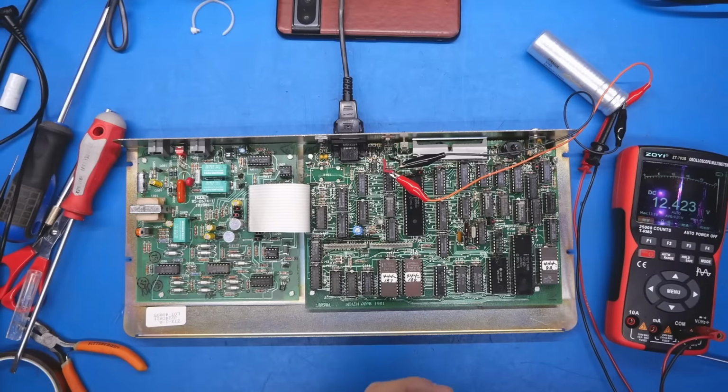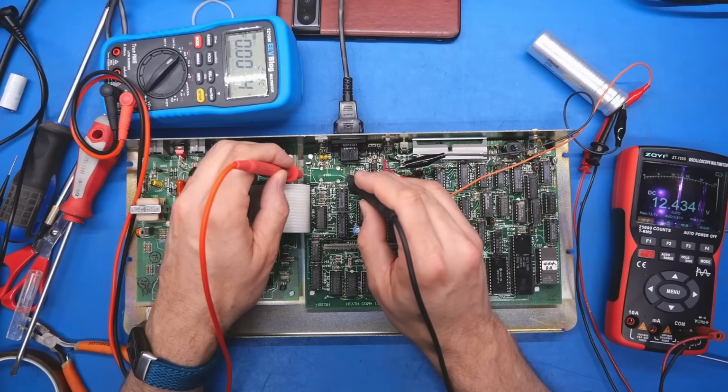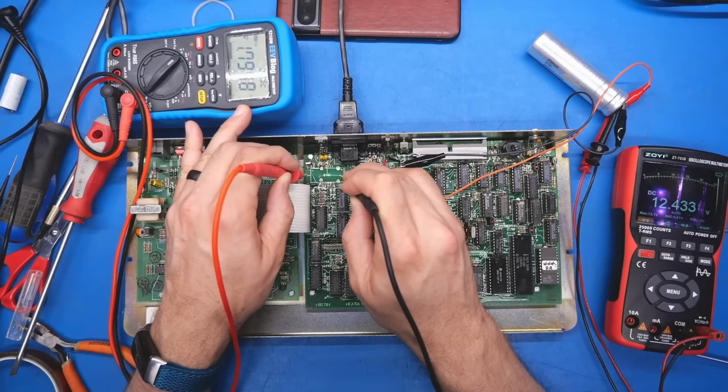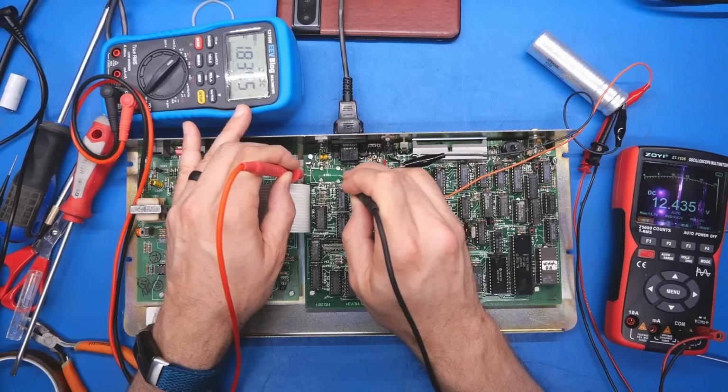Now, I'm wondering if the smoke that came out of this was maybe the battery, because the charging circuit is going to be trying to charge it. Well, the pads are completely gone. 1.7 volts to the battery? I suppose if that was a single NiCad cell, maybe that's an okay charging voltage, 1.7 volts. Yeah, I think it would be. Well, it's kind of going up on its own too.